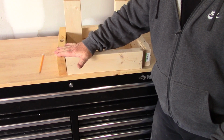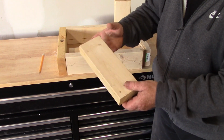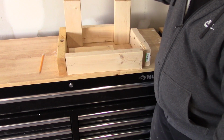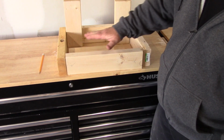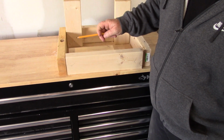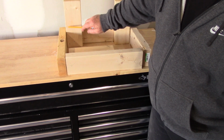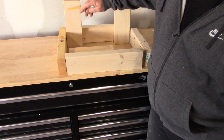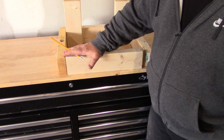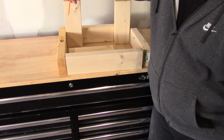So just like a regular 2x4 frame, you just screw them all together. I made my base frame first, and after that was done, I took some other 2x4s for legs, and I set them up like this. And I put 4 of them in. I used a laser level set at 4 inches on the floor to find out where I should put my legs, because your floor is never going to be 100% level. And then you mark off the spot where the laser level shines.